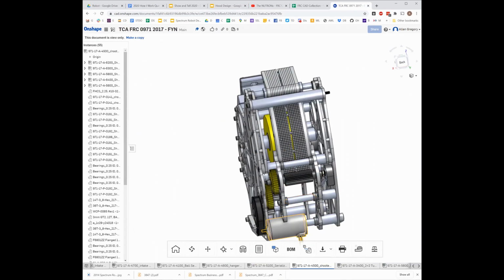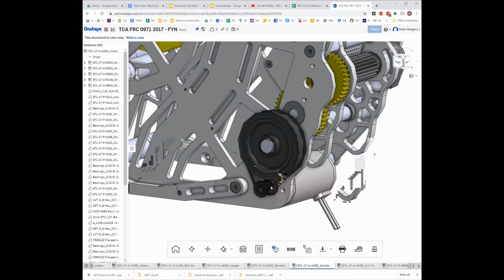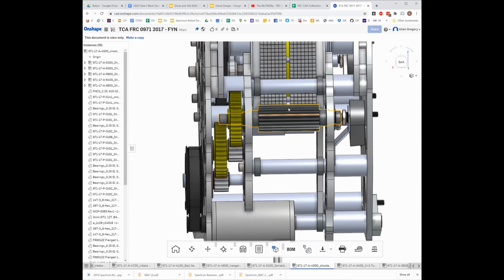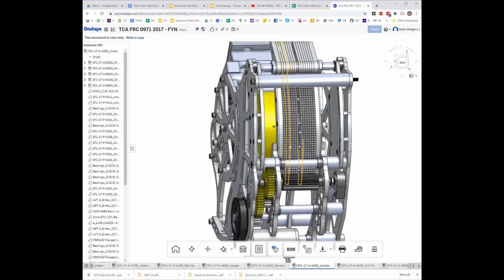So they have a bag motor here that goes to a pulley reduction quickly. And then they have two gear stage reductions. So this is spinning. So you do a lot of reduction to get this spinning very slowly, right? So it has a lot of torque. So that offsets some of the problem with the gear rack being able to move, just because to move it, you're going through a lot of reduction on the motor. So it gets harder to actually spin this by hand, or for the ball to spin it when it's trying to go through it.